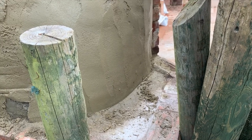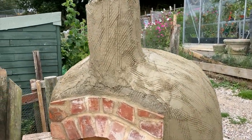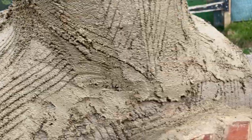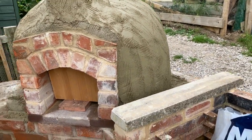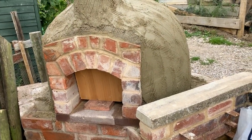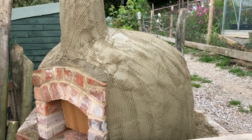I've put two coats on this front half. I'm going to give it a couple of hours and then I'll scratch it. So it's now got its complete coat of render on and I've just scratched it. You must scratch in between coats — it doesn't have to be beautiful or super smooth, it can be lumpy and bumpy, but you must scratch the surface so that the next coat will stick to it. I'll put some PVA glue and water mixture on before the next coat — it wets up the original coat and helps the next coat to stick.